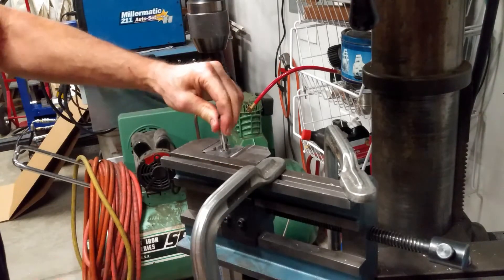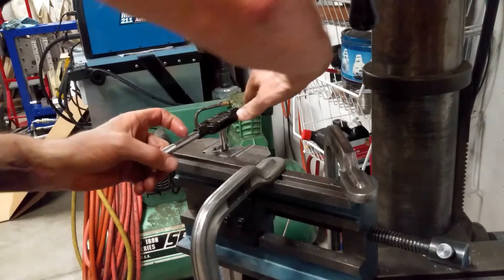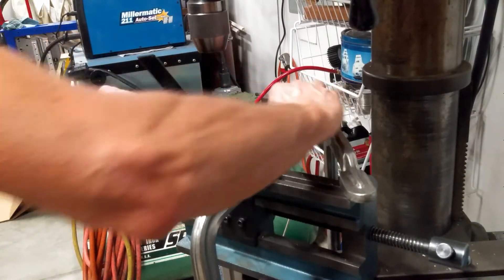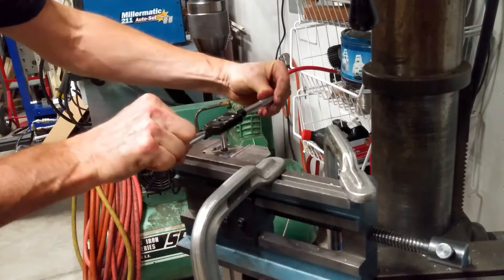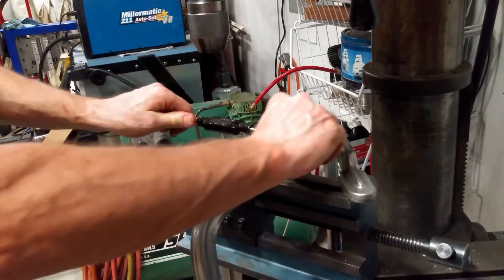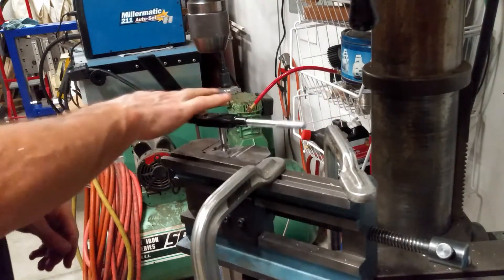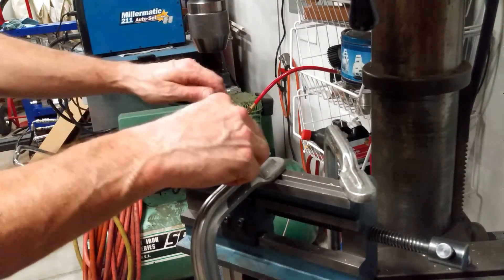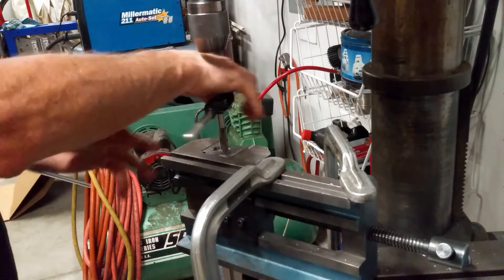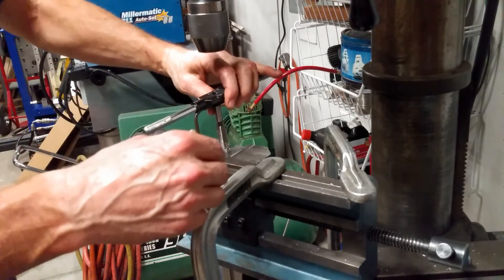Sometimes it's just a little bit too tight. I'll finish it off by breaking some chips and putting it in. I happen to know it needs to go a couple of threads beyond where the tap is so that I can put the full shaft of the foot in. Because of the wall thickness, we're making these walls pretty thin — if you have a longer screw shaft down into the aluminum, it gives greater strength because you're not putting so much force on it. If you drag the table or something afterwards, it doesn't put so much force on it because it's spread out over a much longer distance. It doesn't have the leverage to break the wall.